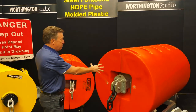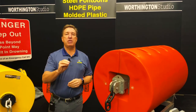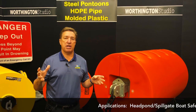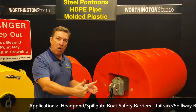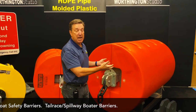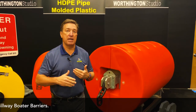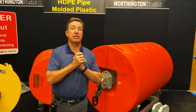These are barrier floats used primarily for safety purposes as boat barriers. We use them in head ponds above power plants and across rivers where you have large tainter gates or flood gates — to keep boaters away from dangerous areas. Below a dam, in the tail race or spillway, they act as boat barriers to keep people from getting close to those gates, where turbulent, aerated water can cause boats to submerge, resulting in injuries or fatalities.